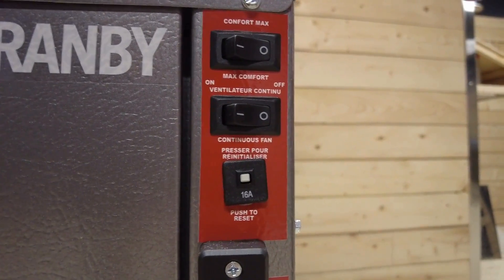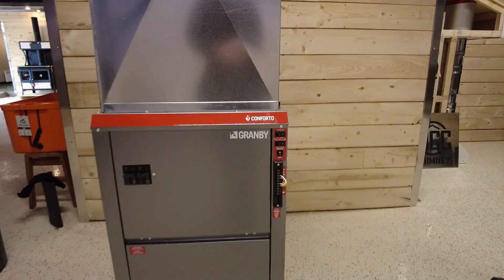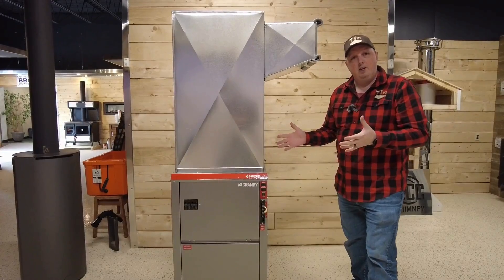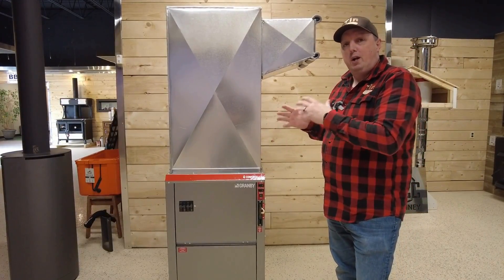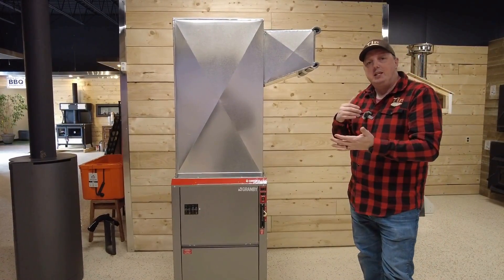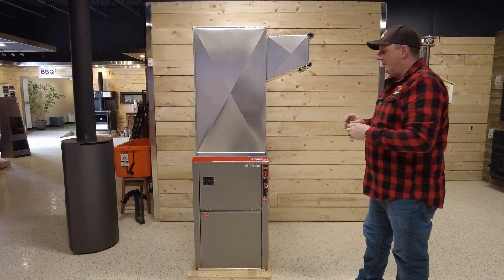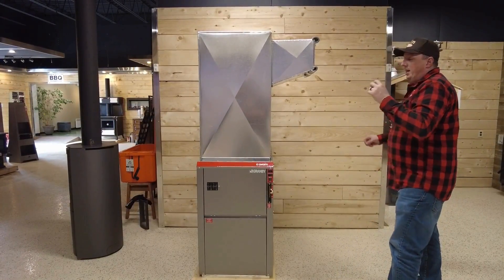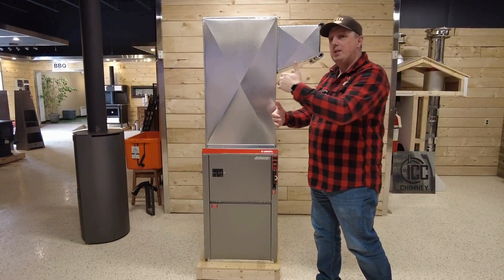What we really like about these furnaces is the Conforto's Comfort Max mode. All electric furnaces alternate their elements, but Comfort Max takes it further. This being a 20 kilowatt furnace, it has four 5-kilowatt elements. It doesn't fire all four elements at the same time. This is different from heat pump elements that are just stabbed in and cut in all at once. With Comfort Max engaged, the furnace starts pushing out heat and brings on elements gradually — adding another element every so many minutes.